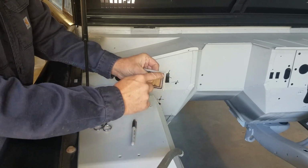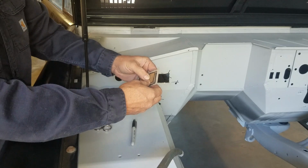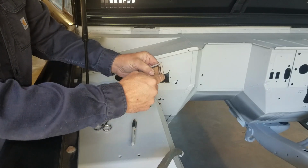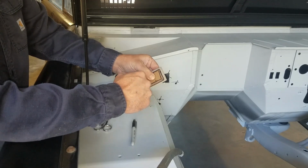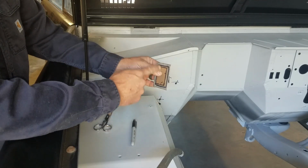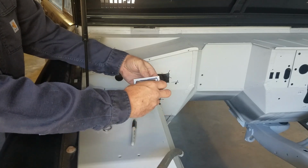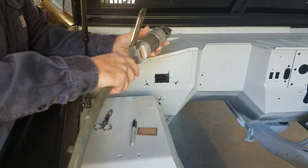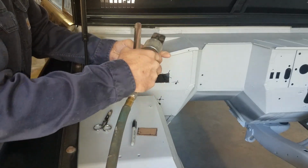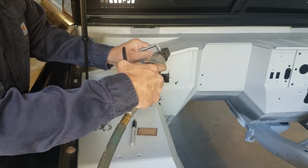The flanging tool doesn't do corners very well, so you kind of have to pick which one you're going to do. And what I may end up having to do is just crimp around it, and then I'll cut the corner out with my saw afterwards. So as you see here, all I need to know is I can put the tool on top of the line and crimp to it. We should be in good shape. To bend down.